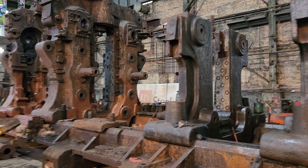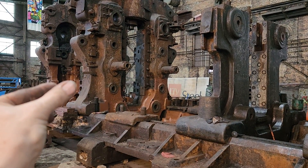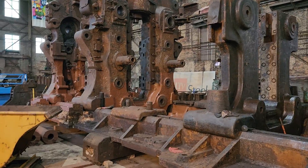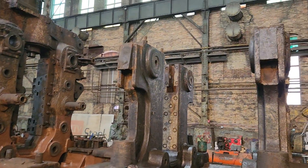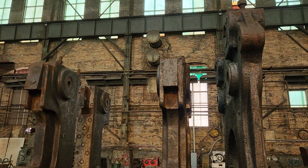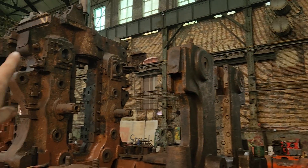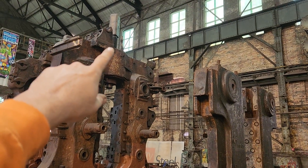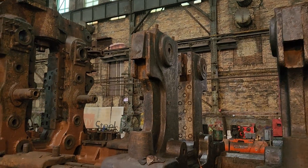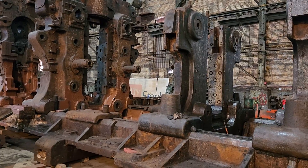You also had the ability to move the work rolls up and down and the vertical rolls back and forth, and those were done with electric motors. The electric motors for moving the vertical rolls in and out were actually up on top of the pinion stand, and all that gets put on later. The one for moving the work rolls up and down was a flat belt drive on a platform back along the wall, and all that will be put back in as we do the restoration.